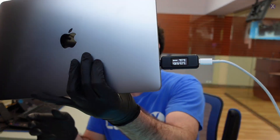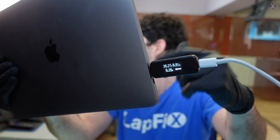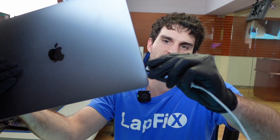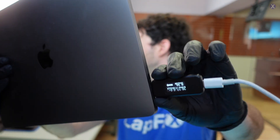So let's take a look to see what issue this MacBook has. The USB-C tester is going to check to see how the MacBook likes the electricity coming in — to see how it's trying to power on and why it's not powering on. We can get ideas based on that once it's plugged in. We're getting our correct voltage — it goes from 5 to 20 volts, which is good, so there's a conversion happening. But it's stuck at 0.01 amps. We check both ports because there are multiple ports that have a circuit behind each one, and different readings in different ports can indicate something very specific.